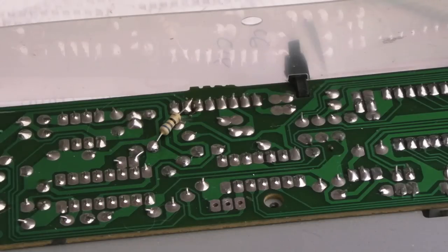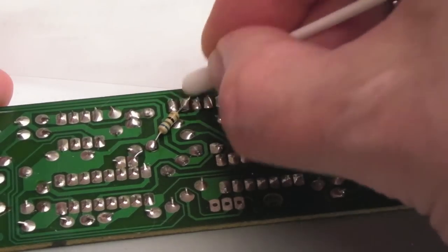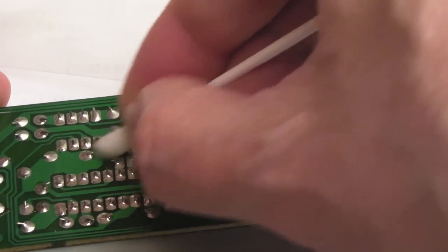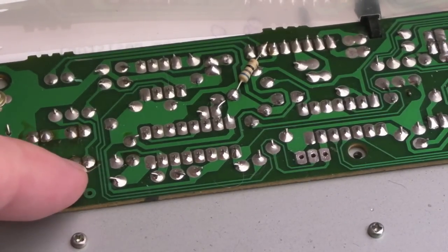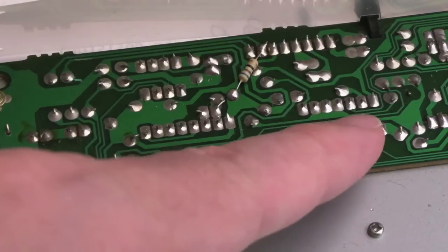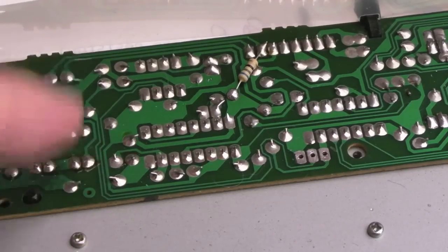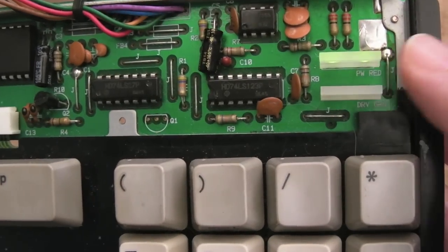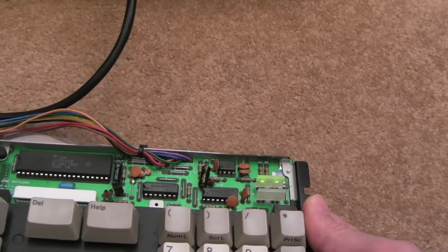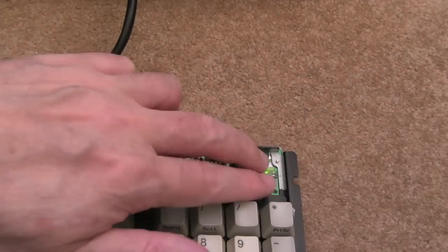The power LED on this keyboard is not very bright — it never has been. It's one of the earlier keyboards, and the LEDs are a bit different between the different boards. Some of the really old keyboards have a completely different colour power LED. The other thing we need to think about is what to do with the floppy LED — we can't connect the floppy stuff up that way to drive it. Maybe do something similar to what we've done here with the reset, so that when you reset you at least get a flash on the other LED, otherwise that LED is just going to sit there dormant.